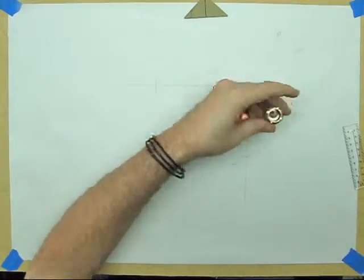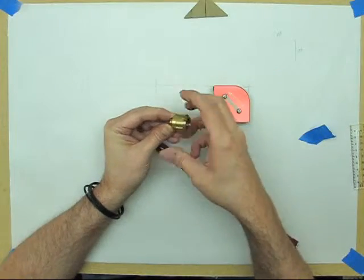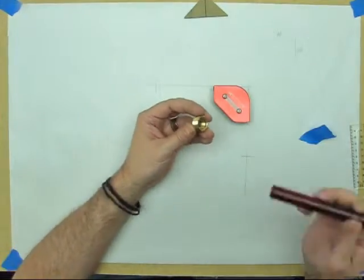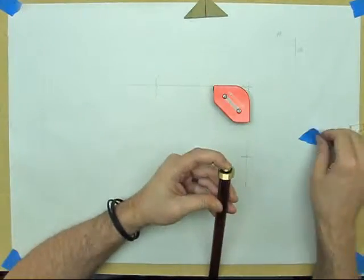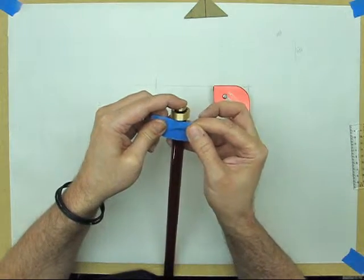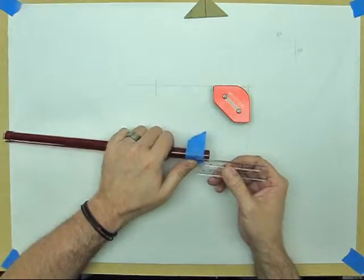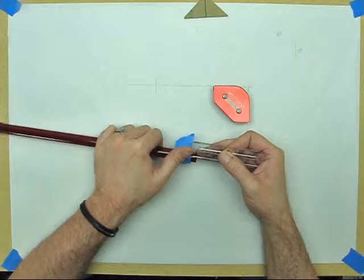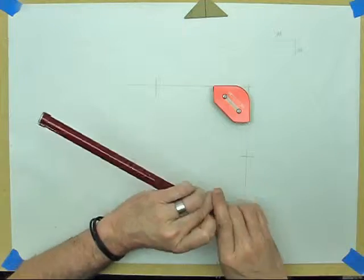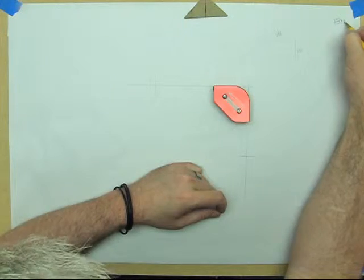You're going to want to take a piece of tube, and I guess I can just take the compression ring off. Because the tube itself actually slides down inside the fitting in the push-in style, you're going to want to push a piece of tube into it as far as it'll go, take your tape, and put it right up against the edge of the fitting and get that dimension. In this case that dimension is 8 millimeters. You'll only have to do that one time for whatever fitting you're using, and then you just write down somewhere 8 millimeters so that you remember that your add-in dimension is 8 millimeters.